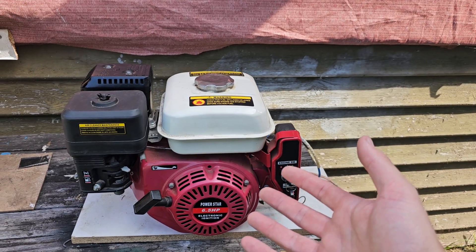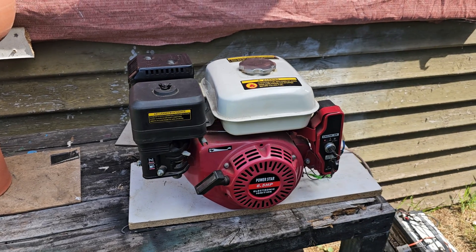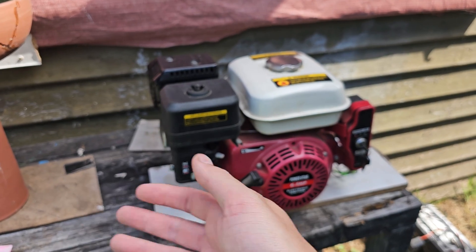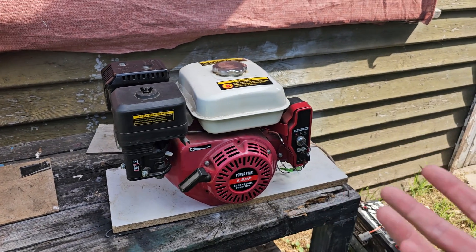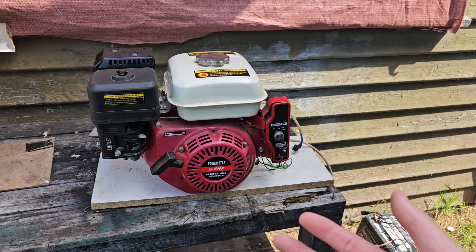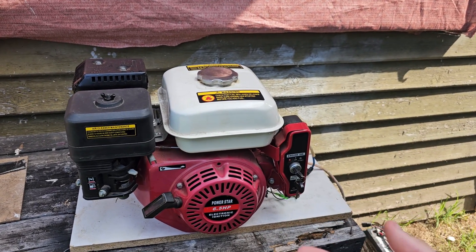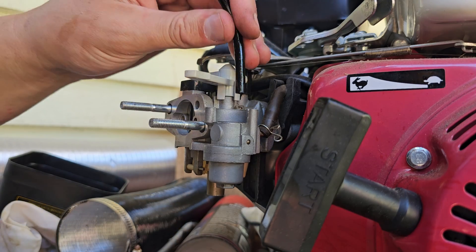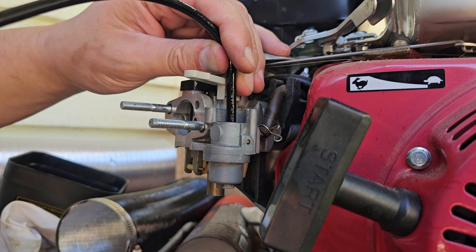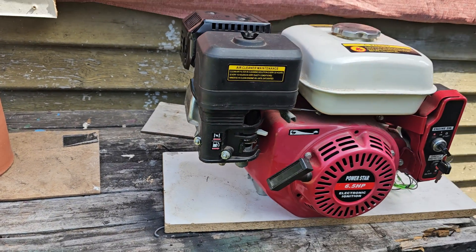His original design for this was to attach it to an alternator to make a generator of sorts. I have pretty much the same idea except I'm adding a 24 volt alternator which should be arriving tomorrow. One of the original problems they had with this is it ran really lean and was hard to start. My brother and my father tried for quite a while to get this running. It took me about an hour — I ended up putting a suction line on the fuel line and sucking some junk out of the fuel. Now it runs perfectly, aside from a crook seal on the fuel bowl which we can replace pretty easily.